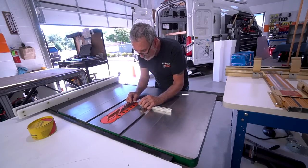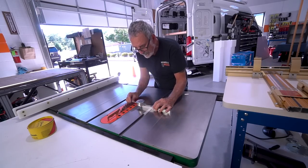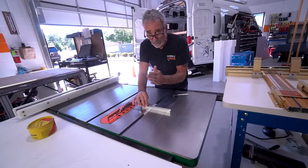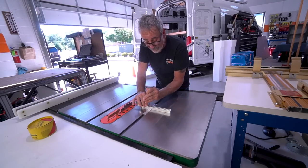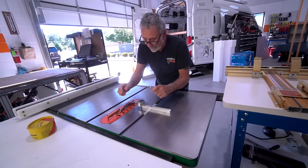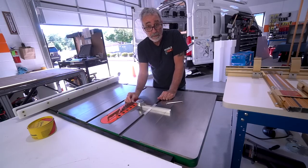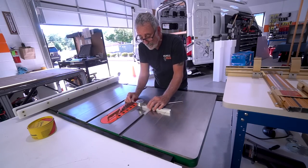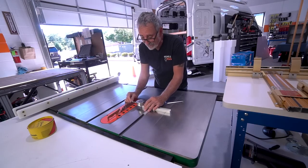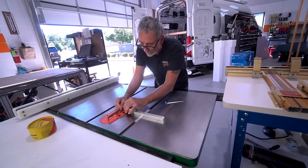We pick a tooth and bring this over, sliding it in just enough so there's a little bit of range of motion on either side of that spot. Tighten that up. Then we put that on the tooth and zero out the machine. Zeroed out. Now I leave everything set the way it is and take this very same tooth down to the other end of the saw.